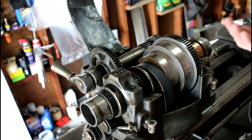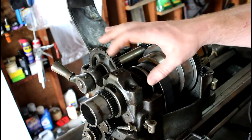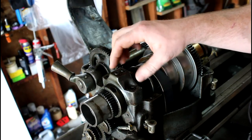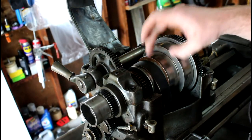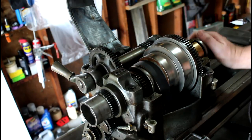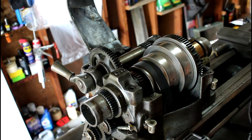So there you go. The procedure putting it back on: get your shims in, cap back on, your two screws. You put the outside caps on first and then your two screws — tighten these down. When you tighten these down, you need to tighten them down to see what your clearance is, because if you just tighten these down and don't tighten the inside ones, this thing won't move. So you need to do the outside ones first. Once those are nice and snug, you do your inside screws and snug them down. Then this thing should spin fairly freely. Once you've got that, you put your plugs in there and that's it.